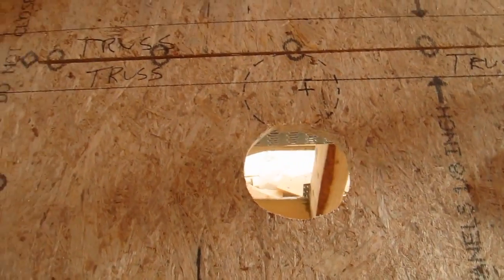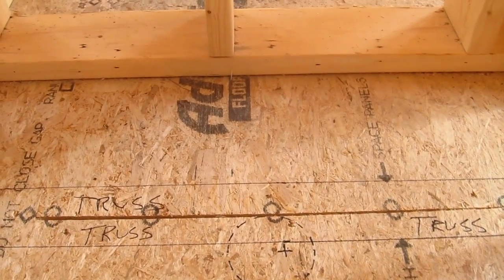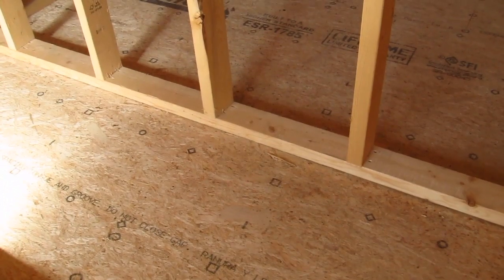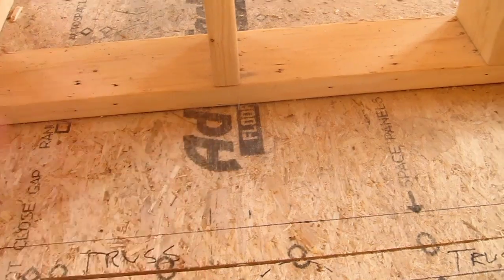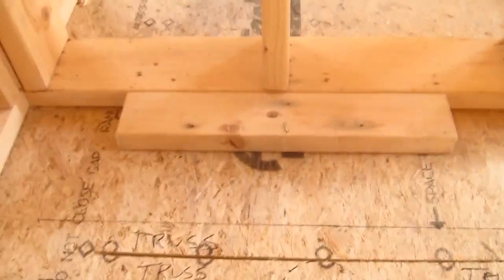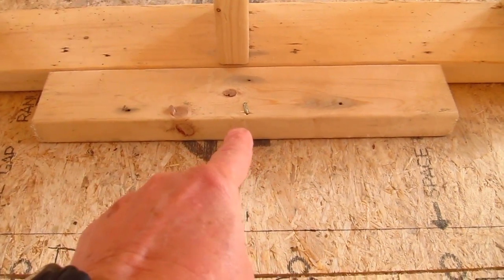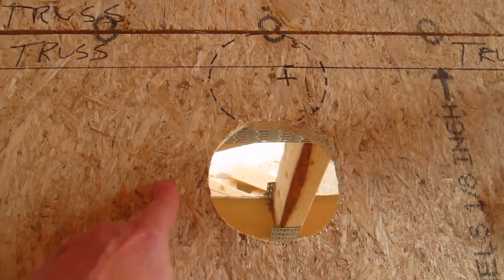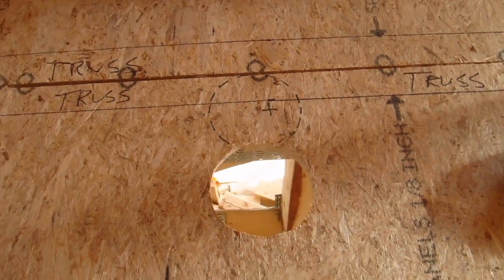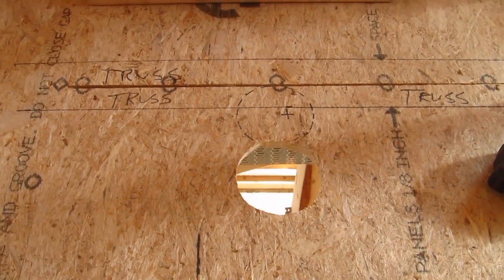Well, look at this. In our case, because this room is so long — six feet — we're able to build an extra two by four wall right here. In other words, we're going to build another wall right here that's two by four. So there's going to be a wall right in front of the two by six wall. And the distance from the face of that stud to the center line of this hole right here is 12 and a half inches. And now my daughter has a huge variety — she can pick whatever toilet she wants. It's going to work just fine.